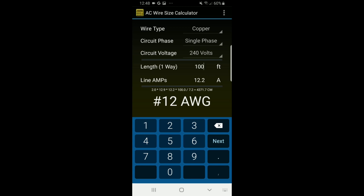Let's give another example. Going back to 40 feet of wire, but now with 25 amps — we have to have a number 10 gauge wire, American wire gauge. If we increase to 60 feet, still number 10. At 70 feet, the same. At 100 feet, still going to be the same number 10 gauge.